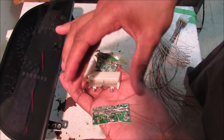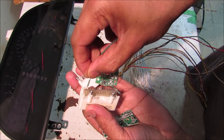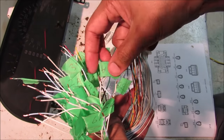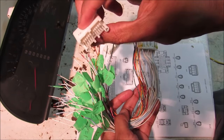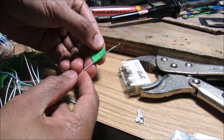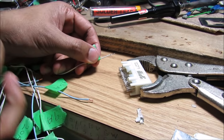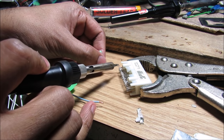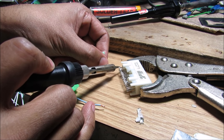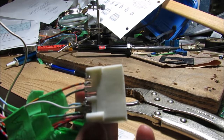I've gone ahead and desoldered the old circuit board off of these connectors, so now I can butt-join the wire from my wiring harness to here using solder according to the wiring diagram and create my harness. I've labeled every one of these wires to make it easy to solder onto the plug. Here I have the female terminal with the pins, and I've got the wires that I'm going to solder individually to each pin according to the wiring diagram. I've put a little solder on my wire as well as on the pin and tipped them together to form a nice firm connection. I've done soldering all my connections to the female connectors.